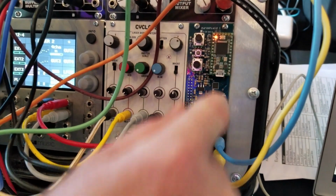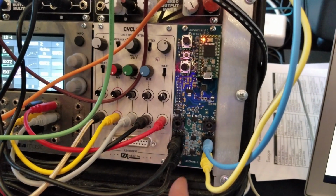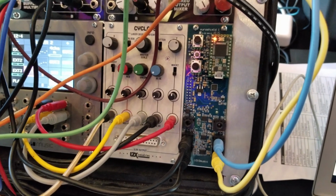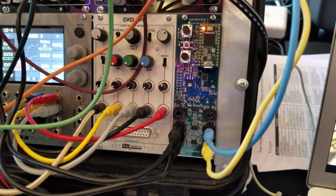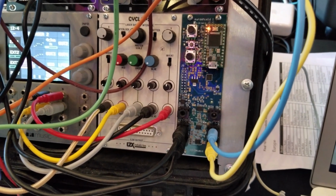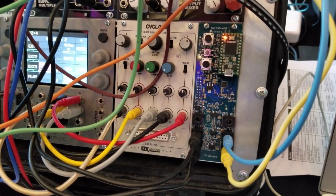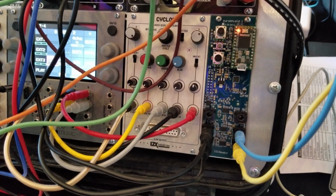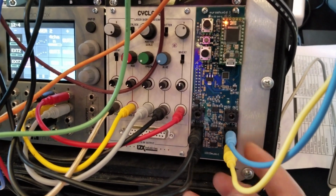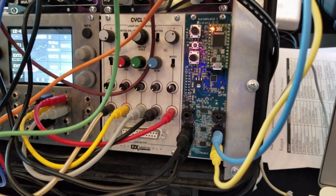So you see the Teensy right here, and then this entire circuit board, which also doubles as the front panel, turns this Teensy into a Eurorack module with a stereo audio input and stereo audio output. It amplifies the levels on both sides so that you can get a full -5, +5, and it goes all the way down to DC, so you can do audio all the way down to CV rates. So this is really optimized for Eurorack much more than if you were to just buy an off-the-shelf Arduino or Teensy with line level outputs. That really wouldn't work anywhere near as well as what you've built here, right? Absolutely, and not only does it have specific levels for Eurorack, it's split them out into separate mono connections, which is how most things are done here in Eurorack.